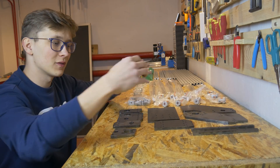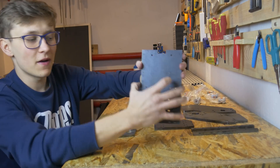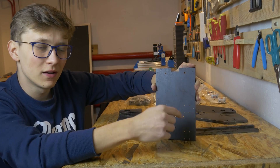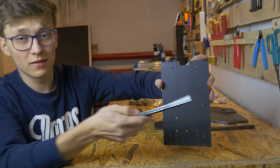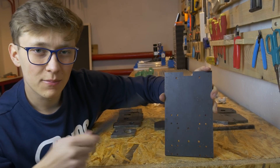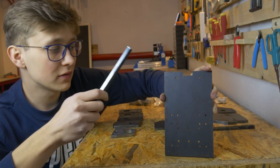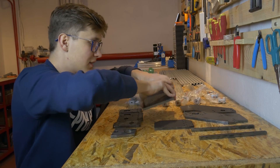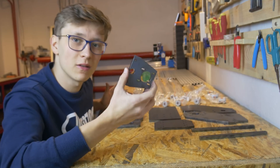Let me talk a little bit more about those steel parts. I found a few companies in Poland and sent them my files asking for a price. One company quoted almost five times more than the company I ended up ordering from, so you have to search around carefully. One problem: they didn't let me know that some holes in my design are probably too small for the laser to cut, so I will have to drill those with a drill, which is not as precise as laser cutting.